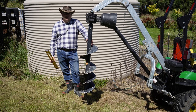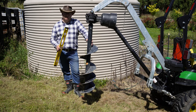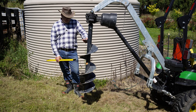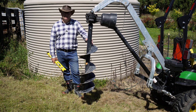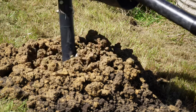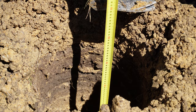If you're building your fence assembly on a slope, you might want to have the posts leaning into that slope. But in this environment here, we're just going to be putting it dead vertical into the ground. Safety first — this thing is able to dig through incredibly hard soil. It's not going to stall or stop or even notice if you get caught up in it. Just keep away from this end; this is very unpleasant once it's moving. So that's 700mm down really in just a few minutes — the auger's done a great job for us here.